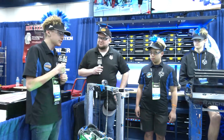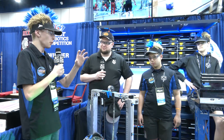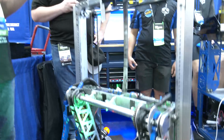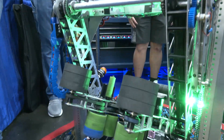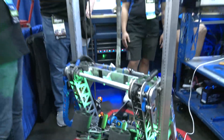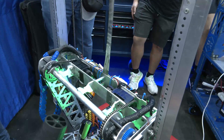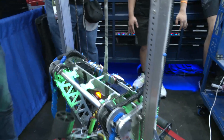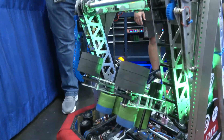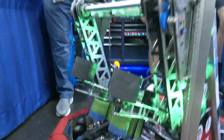While prototyping we realized that more wheels is sometimes better and more grippy material is also better — but you don't want it too grippy or it'll stick to the cone, and you don't want it too slippery or it'll slip. So we went with a round of three wheels, which creates more leniency because the height at which we actually pick up on the cone is very effective to how it will shoot. We have three wheels for the cube on top and on the bottom is for the cone, so we pick up the cone on the bottom and keep the cube up top so we can actually shoot the cone further — from nearly the other side of the charge station.